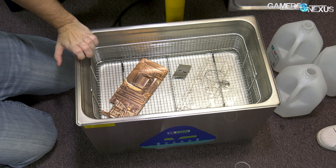It's been a few days. We did put the block in the ultrasonic cleaner and left it running for a few hours. This is what it looked like post-ultrasonic cleaning: it seems like it helped a little bit in some areas, but we also got some tarnishing on areas that were fine previously. So kind of a mixed bag. The ultrasonic cleaner is really good for cleaning off Vaseline and dirt — maybe not so good for cleaning off copper oxide.